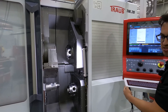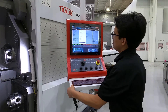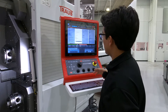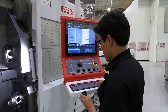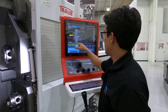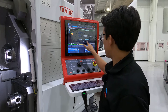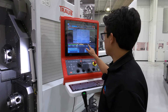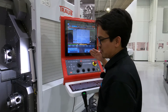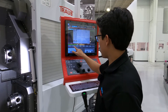I'll go over some of the features of WinFlex. Through WinFlex, we have a couple of nice functions. If you want to make a turning toolpath, you can do that here and it'll give you a 2D wire frame. What you could also do is if you have a family of parts and a certain feature is the same for each part, you could save that 2D wire frame.